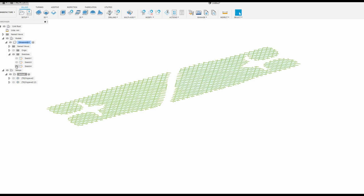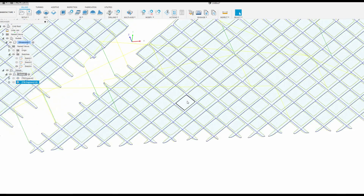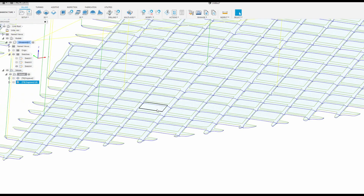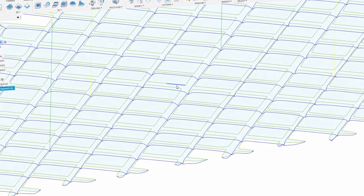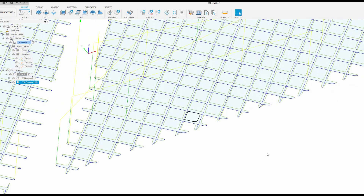And here's where I realized huge mistake number one. I drew a crosshatch pattern the way a normal person would — just crossing diagonal lines. But when I got it into Fusion, it quickly dawned on me that the engraved toolpath isn't going to use those lines the way I meant it to. If you look close, it just cuts the area where the lines are. Since I have space between those lines, it's going to leave that untouched, which means it won't fully develop the pyramid shapes we're expecting in checkering — there are no sharp points. I should have drawn the lines closer together or much thicker.